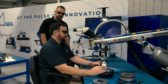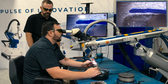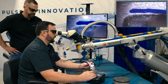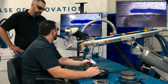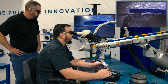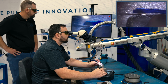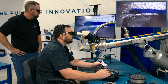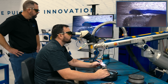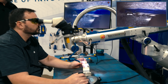Now we're going to do the blow mold parting edge. We're going to go down and find the parting edge of the blow mold — we have some nicks right here on the parting edge, so that's what we're going in to re-establish. What's the material of the mold? The material is 420 stainless, so I'm using 420 stainless filler as well. Most people would think — it's already nicked away, let's just add the weld wire right there. But the practice you should have is to melt that edge away before adding your base material. So now that's all virgin metal.